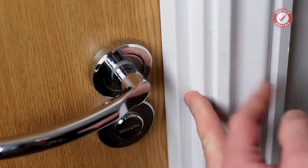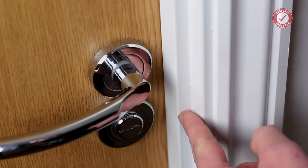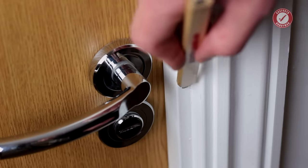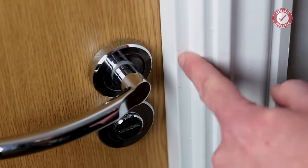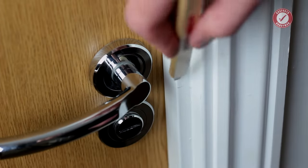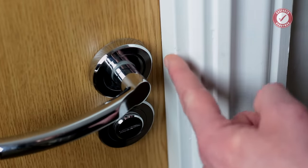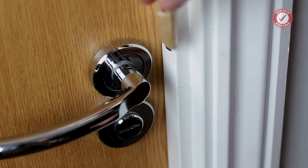There's not enough space on the stop itself and there's not enough space here. And obviously you need to make sure that you can still shut the door. So personally, what I would probably do in that situation is I would just notch out a section of the stop. Obviously you're not going to be fitting at door handle height, but I would probably notch out a section like that — just literally cut out a little section of the stop. It's easy enough to glue back in and filler afterwards. It's not really structural, the stop. As long as you're just taking out this little section, you're not going into the actual door frame itself. You should find that you can do a cut across there, a cut across there, and just get a chisel behind that and take that little section of the stop out. That gives you a much wider section of door frame that you can attach the brackets into.